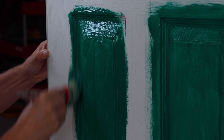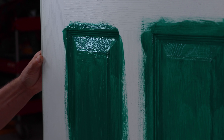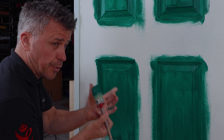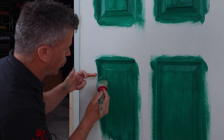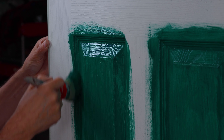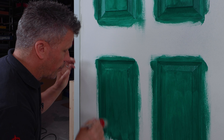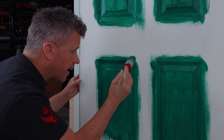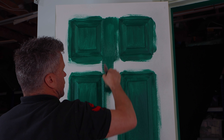When painting these panels, I tend to apply the paint across here first and then start to squeeze it tight into my corners. Of course, these are recessed and quite deep — you've got mitered little corners and these are the vulnerable bits where you're going to get drips. So apply the paint on first, making sure you've got plenty on your brush but it's not dripping, then press the brush tight into the corners and drag it across. There's a little lip just on the end here that you don't want to catch, so press the edges of the brush tight into the corner and drag them down. Then once you've got all the paint on and it's looking good, you can feather over it really lightly with the brush, not putting any more paint on nor taking any more off.